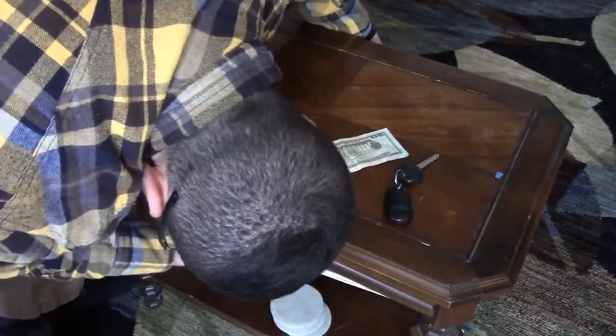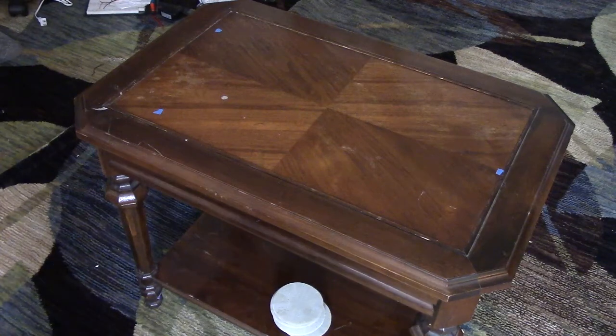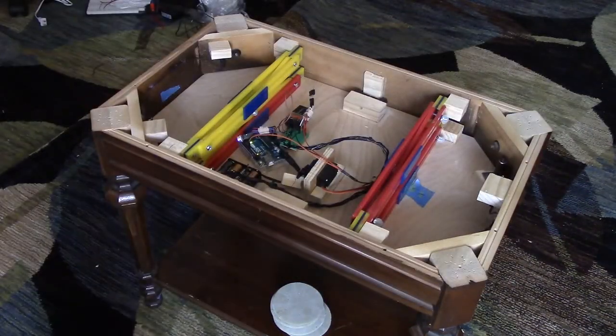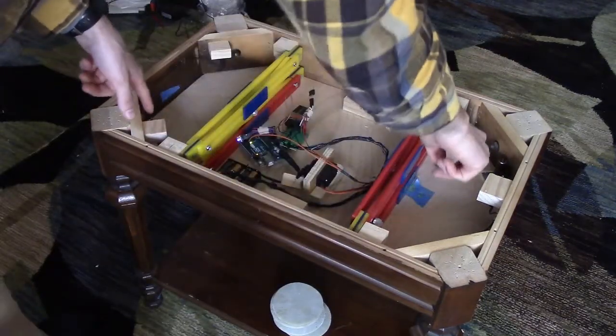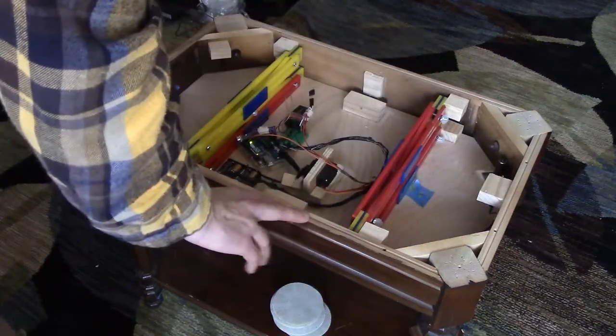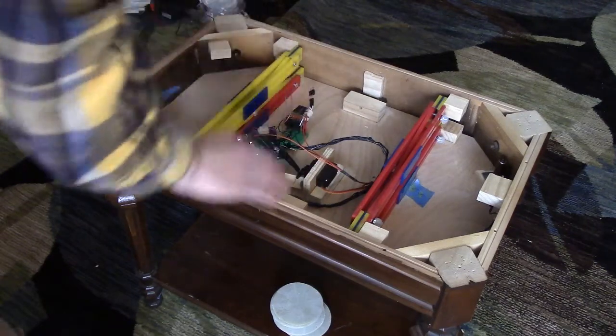This was designed to keep power consumption at a minimum, so the motor is not active during that time and it closes passively. Let's take a look on the inside. We're going to remove the top temporarily. What you'll see initially are the two acrylic scissors that I made to help raise and lower the platform. You'll see magnet holders for cabinet hardware that keep the bottom from falling, some magnetic sensors on the side, the Arduino, a servo motor, a voltage regulator, and a microphone.